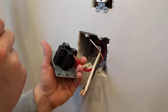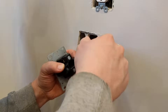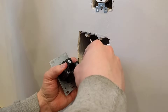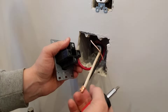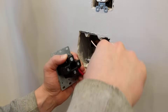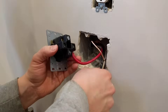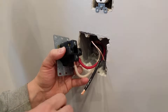We've got this stubbed in here and we'll go ahead and tighten this up. What you want to do is tighten it down, and when you think you have it pretty tight, go ahead and wiggle it like this — then you should be able to tighten it some more. Do that a couple of times; it helps the individual strands of copper separate and allows you to get it nice and tight. That's important since we've got such a high amperage application here. Now we'll move on to the neutral, paying attention to how the wires are in the wall so we'll have the easiest situation possible for getting them pushed in.